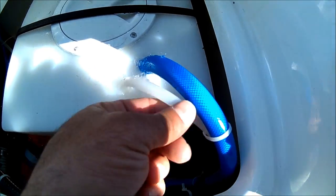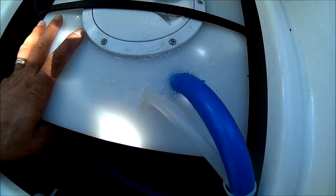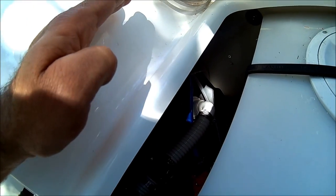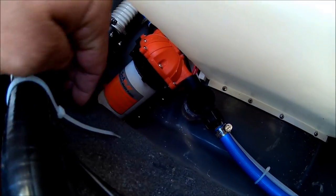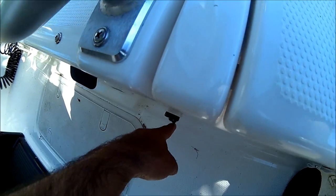This line here is your vent line. If you don't put a vent line, the tank is not going to work — it's going to create a suction, and you're going to burn down the pump. So you've got to run this vent line all the way down and place it at a higher level, right up to here. That way water does not spill from here — it's only air that comes out. Now for power, run the power line right through here, then it exits from here.